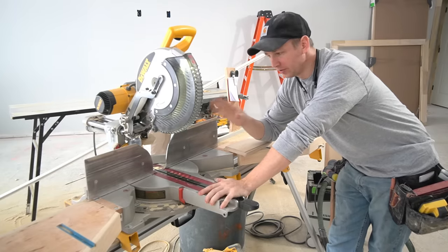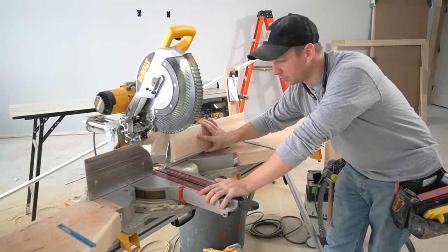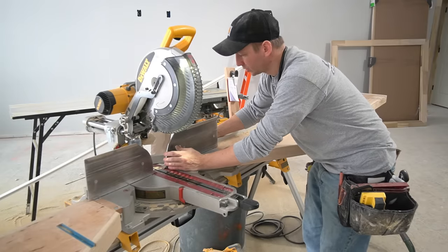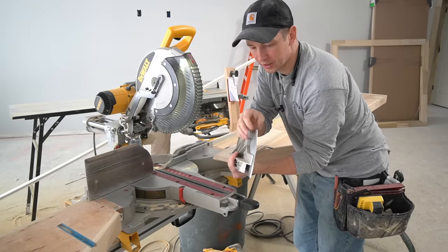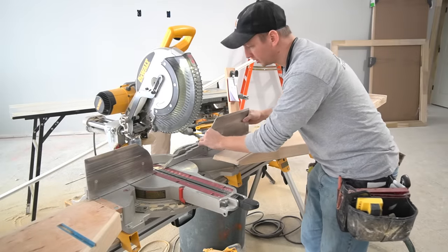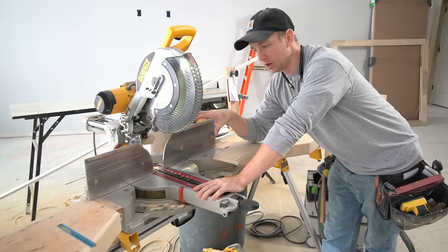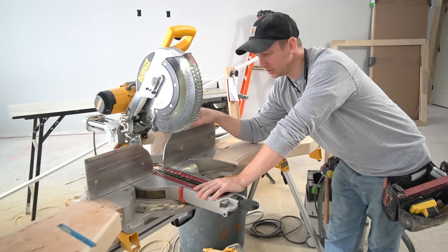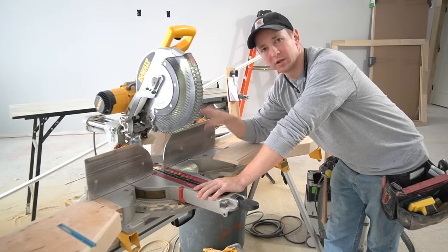Because I get asked this in almost every video where I show my miter saw — I do have auxiliary fences on the miter saw. In order to cut a lot of baseboard in the vertical position, you're going to need taller auxiliary fences on your miter saw. These can be purchased — it's just a piece of aluminum, nice and tall, nice and thin, doesn't have a big buildup, and they come pre-drilled for your miter saw so you can mount them right on your existing wings. They're really easy to take on and off. I always try to put links to the products I'm using in the video notes. In this case, these fences are not affiliate links — it's just a company I appreciate that makes a great product for your miter saw.